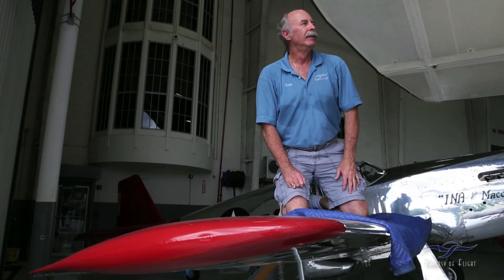And then I went out over to the east, and I came around. I was going to make a little pass, but not a fast pass. But when I started to put the nose down, apparently what happened was I was marginally on. There's a cable that runs around the cowling that holds it in the back. The only thing I can figure is it's got a split in the bottom, and it didn't get tight enough. So when I started increasing airspeed and the pressure started building up in the cowl, there's a little indentation that the cable lays in and goes around and squeezes everything down. It wasn't tight enough, and basically the lip bumped out. I think the leading edge, the nose of the cowl, came back and hit the engine. That's all she wrote. Anyway, it nicked the back of the prop.